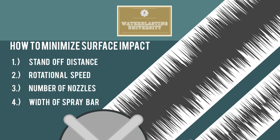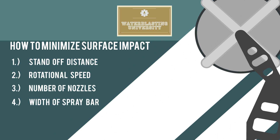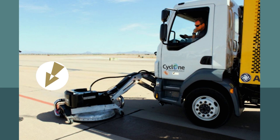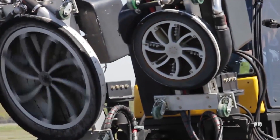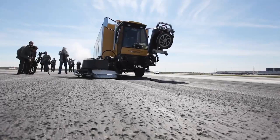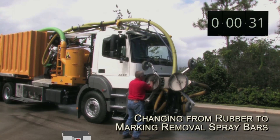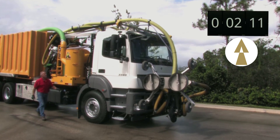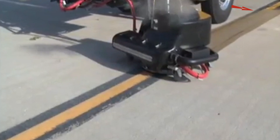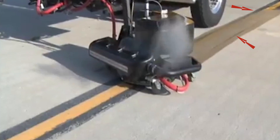Fourth: width of spray bar. It's important to size your spray pattern accordingly to what you are trying to remove. Here you see a great example of what not to do: a very thin line being removed by a very wide spray bar. Some machines give you very little options relative to spray widths, like two permanently mounted configurations with only two widths. The Stripe Hog allows you to quickly change your spray bar in minutes so that you do not impact the area outside of the removal zone. While the 36-inch head may work fine for rubber removal, there are no 16-inch wide markings on an airfield, and you cannot remove an 18-inch wide line with an 18-inch wide head in one pass.